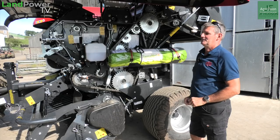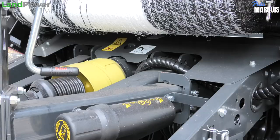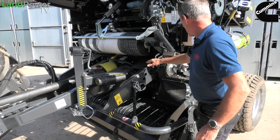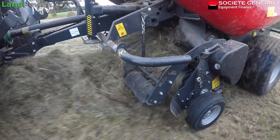Let's start at the front — drive lines. 540 drive in. We now have a one-piece gearbox across the front, just like the Fast Baler. The jack and the drawbar are actually fixed to the gearbox housing, so it's a structural component. The drive goes out the right-hand side for your rotor, and out to the left to drive your rollers. Strong, heavy-duty, well-built gearbox in there.